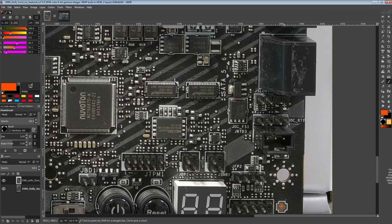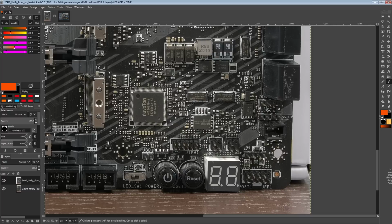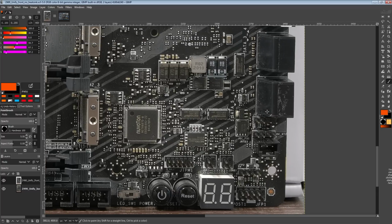Above that, we have LN2 mode, which just loads up some LN2 cold bug removal voltages. It doesn't actually change voltage ranges at all, which is pretty cool. And J slow, which is just slow mode. It's like manual power savings for LN2 overclocking, is the way I use it, because what it does is force the CPU down to the lowest possible clock speed. So if you're saving screenshots or just messing around in the OS on LN2, that's a great way to not burn through it. Because if you go from 6 gigahertz to 1.2 gigahertz, you cut your power consumption down to 1/5 of what it originally was, even if you don't change the voltage. And that reduces how much LN2 you're burning off, even if you're just sitting idle.